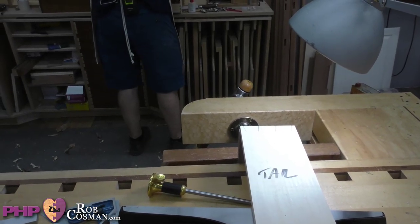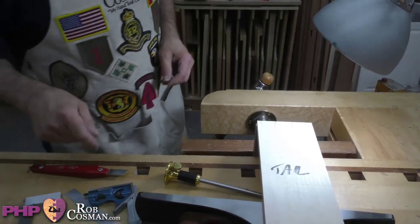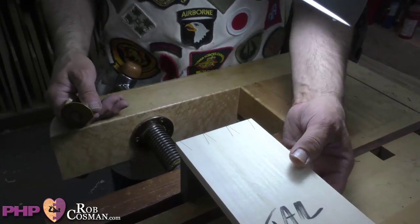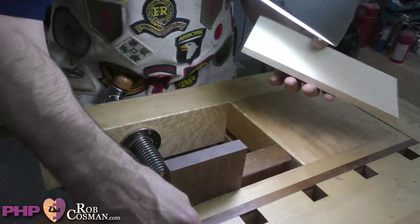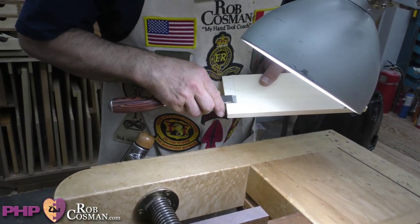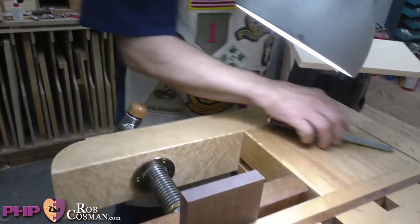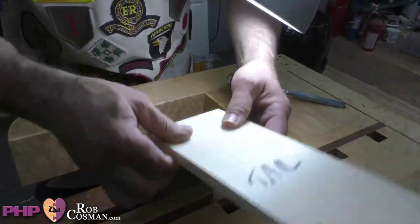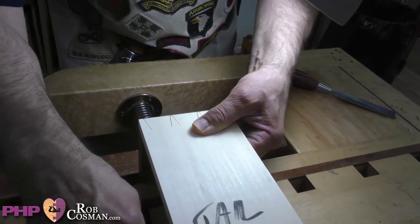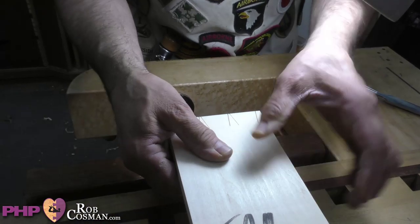I need my saw with my dovetail mark knife with the sawtooth blade. And that's a critical part to this. If you've never seen me cut dovetails before, that's why we cut that shoulder. And by the way, we want to make sure that all of that sawing fuzz is off of there so it doesn't give you a false reading by having some little chips of wood block that corner from being right up tight. So that's sometimes why I like to just move it like that a little bit. Get that in position, slide it over. Now I know that's moved over. It's offset by 24 thousandths of an inch, which is what that measurement is, and hold that firmly.